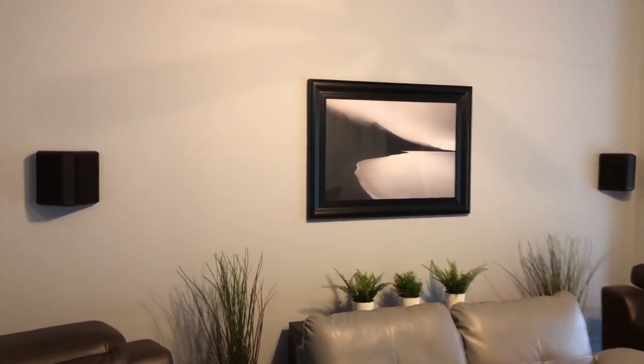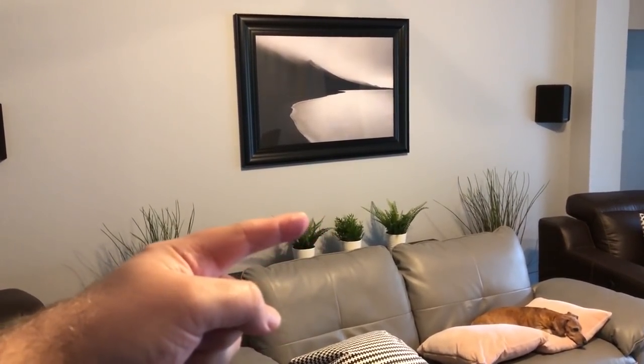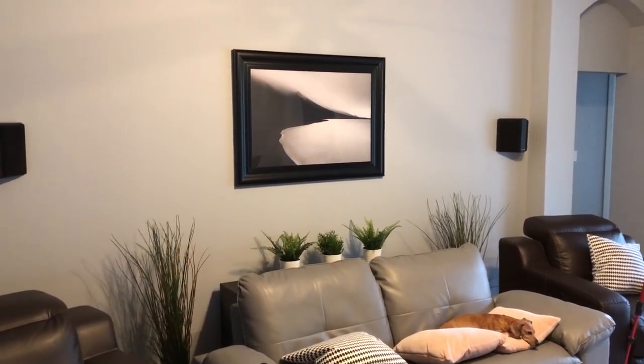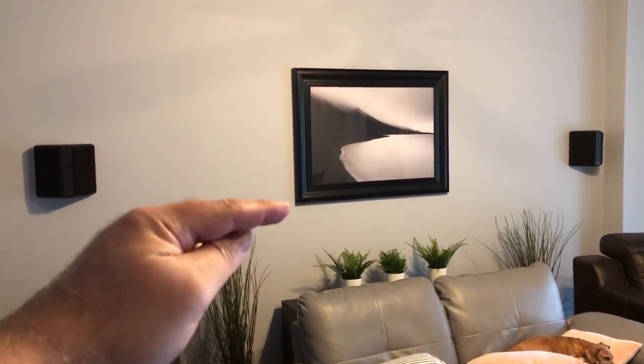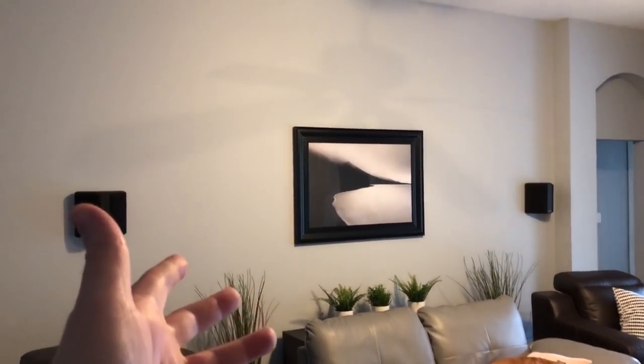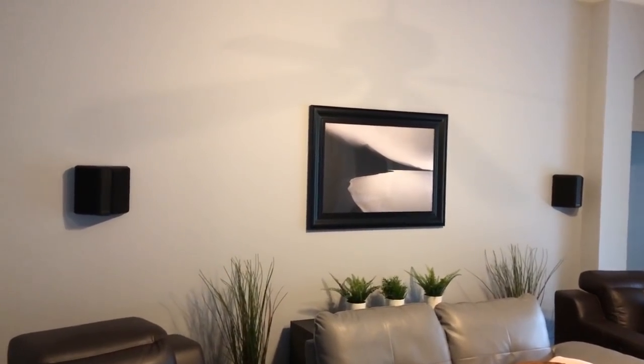So this is what we're working with. This picture is two and a half feet tall; the new panels are four feet. I'm going to start the bottom about level with where these plants are, about a foot off the table, taking it up to about here on the wall. I'm less concerned with blank space up top than below, because when you're sitting on the couch, your ears are sensitive to what's bouncing right behind them. You never want to completely cover a wall in acoustic panels — you need a mix of direct and reflecting sound.